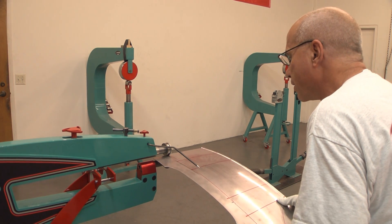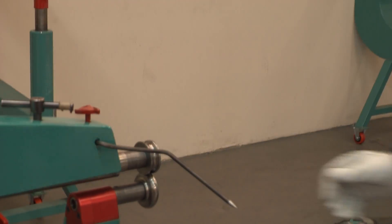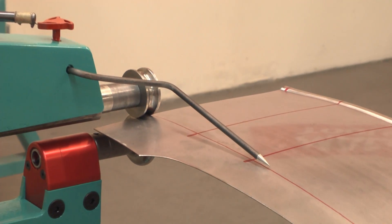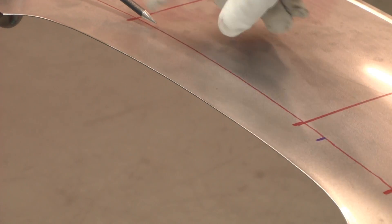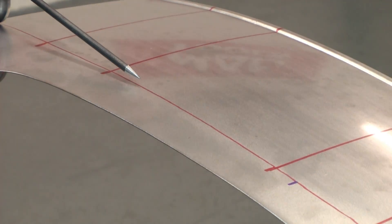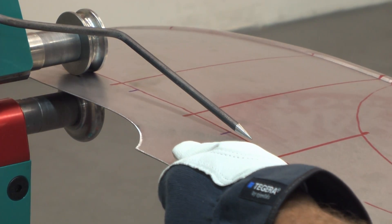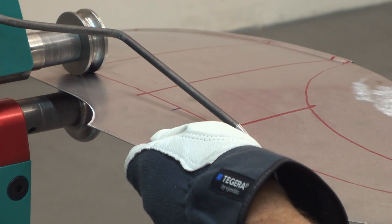I start just a little bit there to see — I'm all the way down with the first pass. I have a good start. I turn down the speed a little so it doesn't go too fast. All I'm focused on now is that point — I'm going to run it to the blue mark here, because that's where I'm going to stop with the die. The point is probably going to be down here somewhere, and then I need to do this by freehand. It's very small movements there.